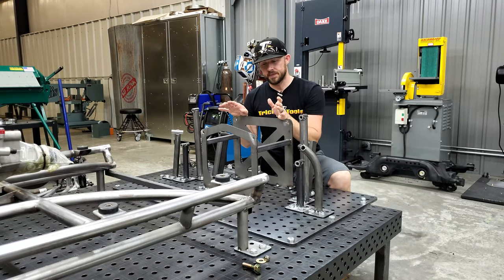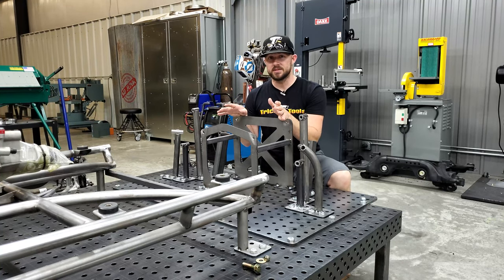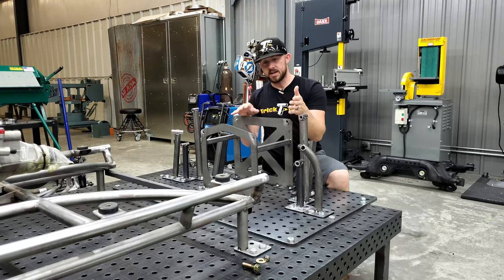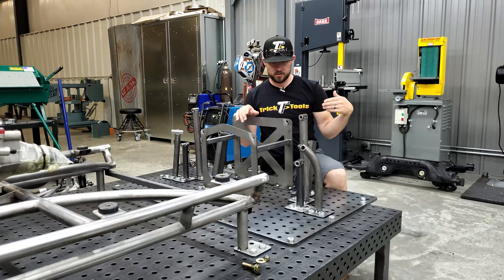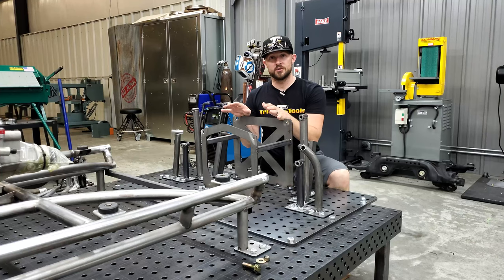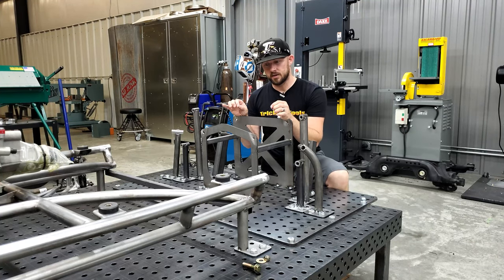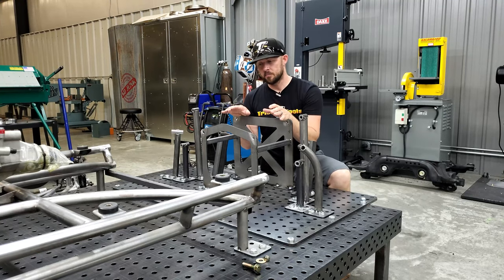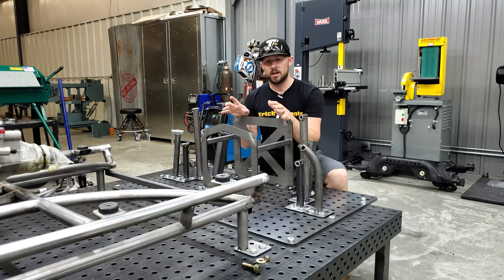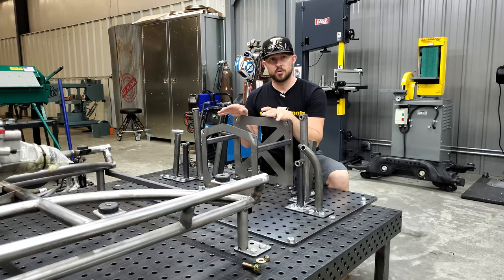There's a chance that by the time you get one bend, this bend, come back here, other bend, and get around there, it's really hard to do that many bends and get it to land exactly where you need it to the degree and to the specific measurement. We do as much homework as we can, as much calibration on the bender as we can, to know our bends and know the bender and know how the machine's going to operate.